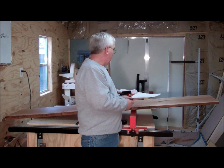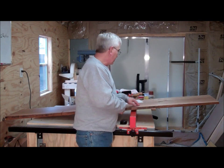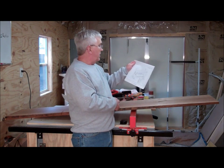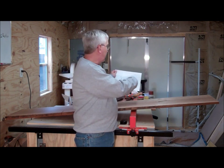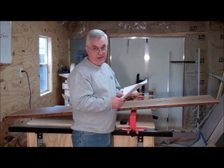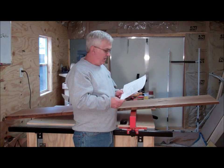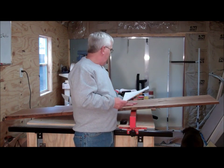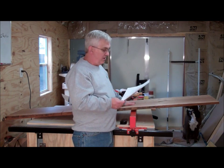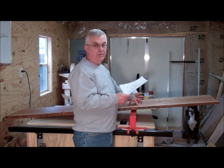First step in today's project is to figure out where to cut because some of these boards have got a couple of knots and a few bad places. So I'm going to first cut my pieces down to size and try to eliminate the bad spots. Then I'm going to run them through my thickness sander that I now have — I finished that up two or three weeks ago. It's a good thing I made it plenty wide enough; it'll do 18 inches, so I'll be able to run these things through and get them smoothed out, get some of the scratches and stuff off of them, and then get ready to run them on the CNC.